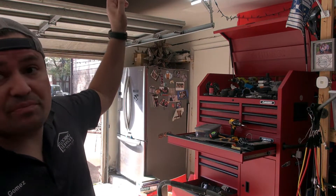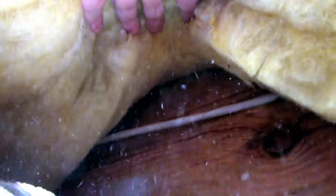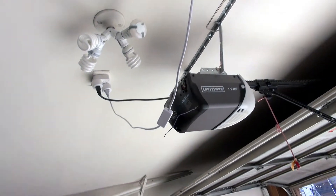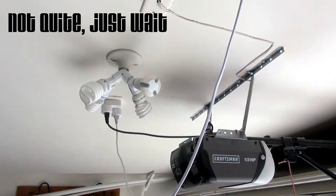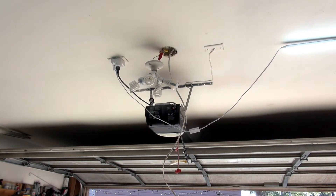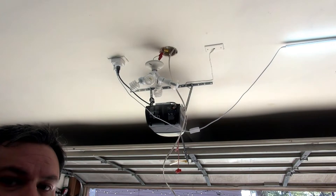I'm gonna try to reuse this to patch this up. I got a little bit of insulation and I just gotta make sure my cable is actually up there. There's my cable - that's what I'm gonna be tapping into. This tester beeps when it's live, so that thing is live. I'm pretty sure this is probably going to that outlet, so I gotta find the one for the lights because that's the one I'm gonna use.